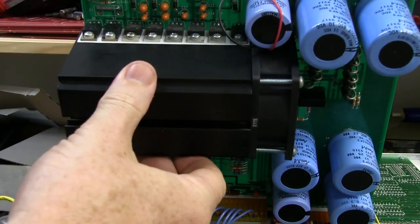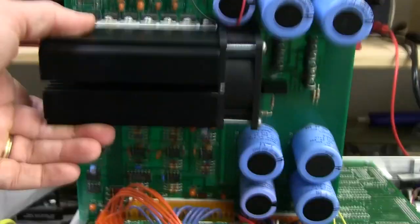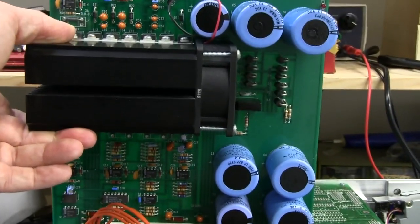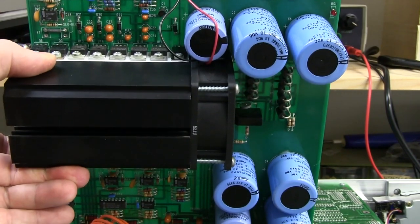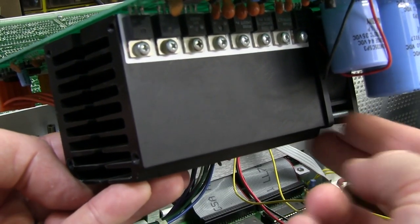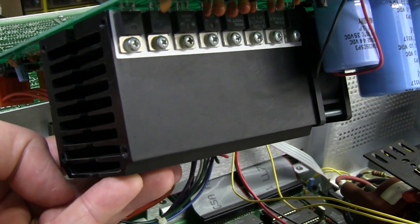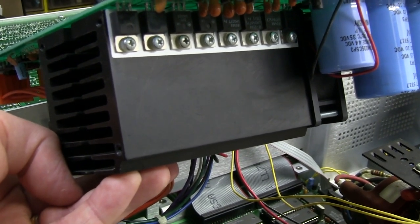Here's the power supply when we lift it out. I had to do the four screws on the back grill because the heatsink is actually screwed into the back panel. I really like the design and layout of this power supply — how it just flips out like that. There's the main transformer on the back. The heatsink folds down and mates up with the back panel and screws in — really rather neat. It's also sharing a bit of load with the aluminium back panel, using a bit of the chassis. They've got the fan on one end which sucks air through the fins and straight out the back. Chock-a-block with devices on both sides. I think we've got a whole bunch of linear regulators there.